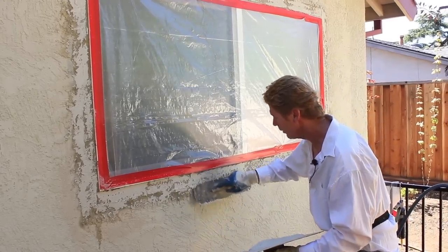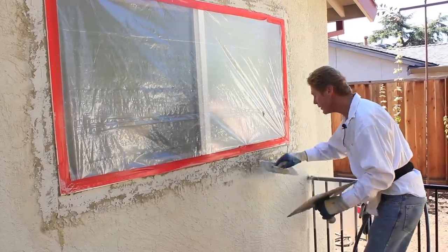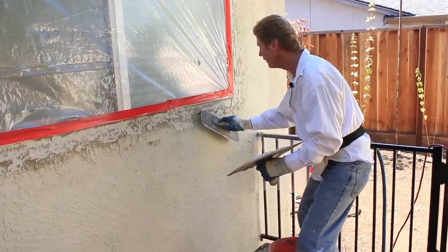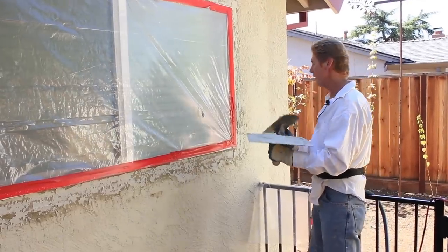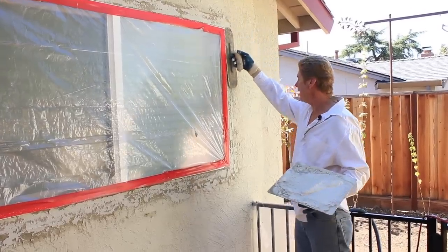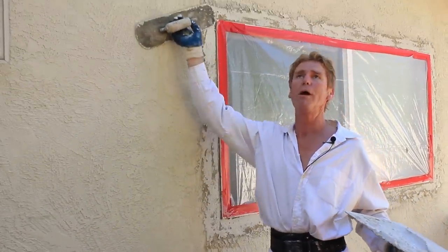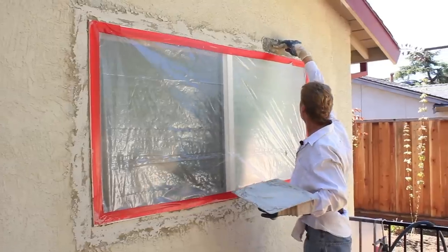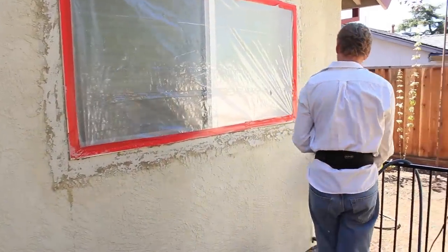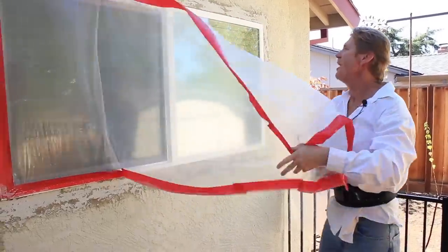This is another good thing about Wellcrete — you put the bonding agent a little further down because this is painted and this will adhere. Sometimes you need to go a little bit further down than the patch itself. Sometimes we feather right into the patch, only if it's a float finish or dash. And if it's a skip trowel, you get a little bit over. My skip trowel is a little bit more prominent in there, so I'm going to take it down. I'll take this and all I'm doing is knocking it down. You don't have to look guys, just follow that wall. When we've got that, put the tools down. The fellow who says hey man, I'm faster than you, I don't cover — that's pretty goofy, because all I do now is uncover and I'm done. Otherwise I could still drop a little bit and it could hang right off the edge of the trowel and go on that window. If it gets in there you've got to pull it, so it's a real drag.